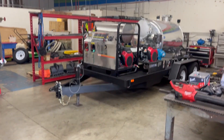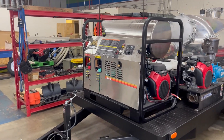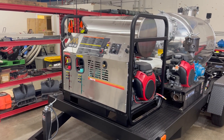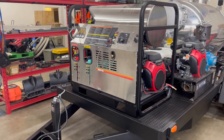There she blows! It's on a 6x16 foot trailer. It's got the HCS 3208 — you guys might have seen the unboxing video on this. That's the hot water skid: 3,000 PSI, eight gallons per minute, or nine depending on what pulley you put on the pump.